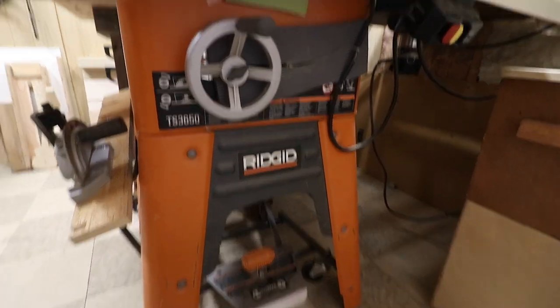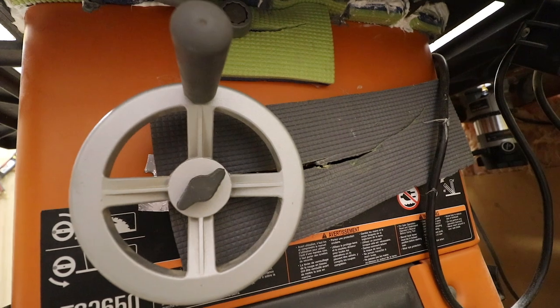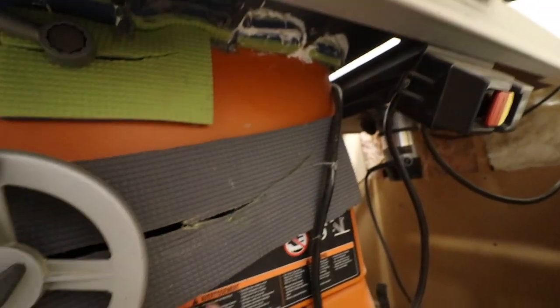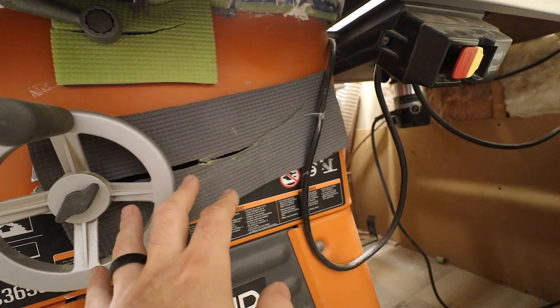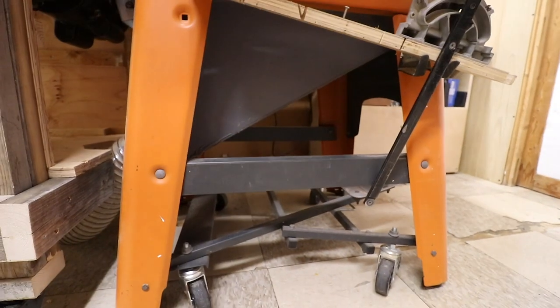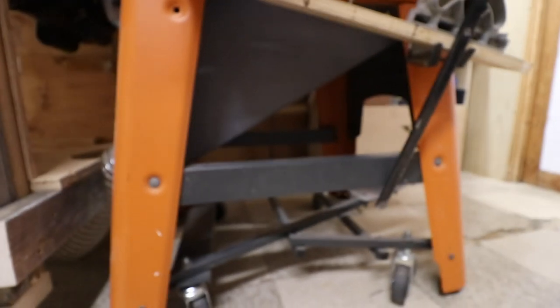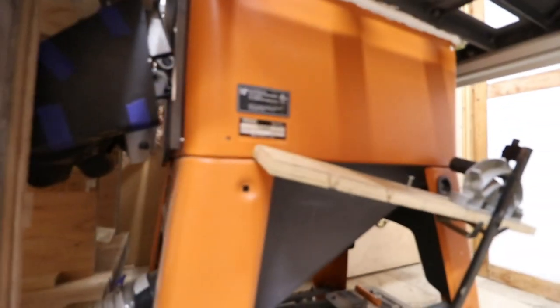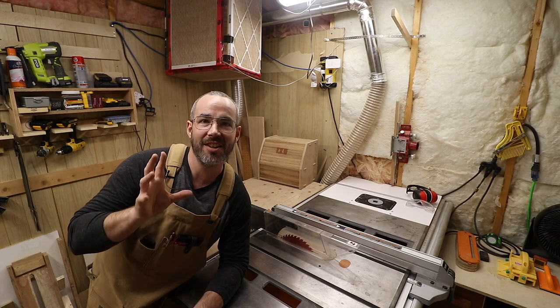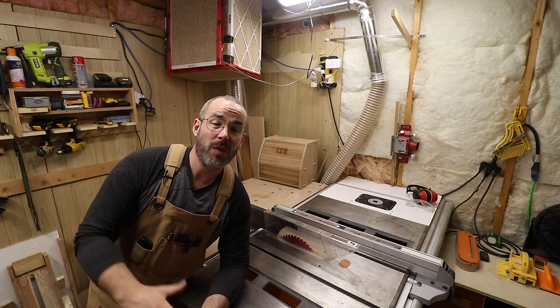A really big change I made when I got the table saw was getting some dust collection on it. I sealed around the top with caulking and foam — just an old foam camping mat — creating a way for the blade guard to rotate and move while still sealing everything off. I also didn't like the way it was collecting dust, just getting a massive pile underneath, so I built a frame that goes around the base of the saw and comes out in a nice four-inch dust port at the bottom going into my dust collector. It's definitely still in need of improvement, but it is light years better than when I first got the saw.